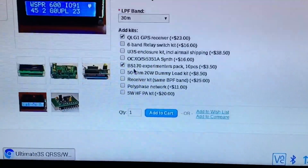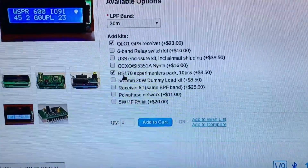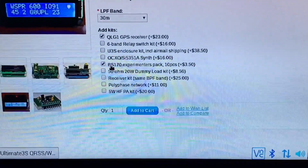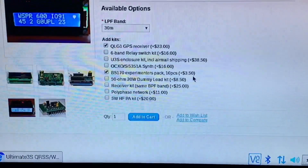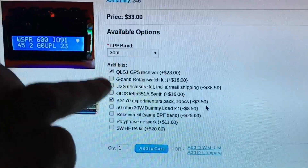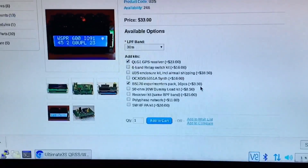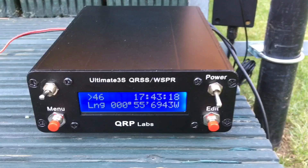You can also get extra transistors — a pack of BS170s. I would suggest you put all three in and run it at five volts; it takes the strain off the single PA transistor. I've butchered loads of them, so now I always put all three BS170 transistors in. It's only a couple of quid for a pack of 10, so well worth it. Don't bother with the relay board kit for now — just get the standard one going, add to cart, and away you go.